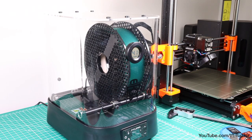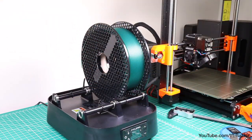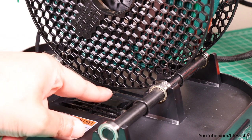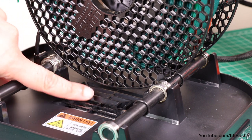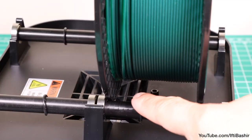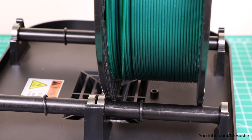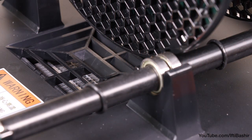There's one issue to be aware of though, which could be a deal breaker for some. As the hot air exhausts directly beneath the filament spools, that hot air is being blown directly onto the bottom of the spool — meaning the plastic at the bottom starts to become softer than the top, to the extent where some plastic strands can start to sag with loosely wound spools. That's potentially a big issue when it comes to 3D printing.